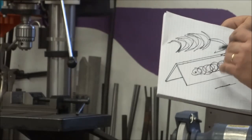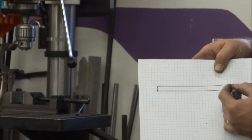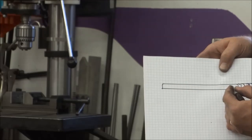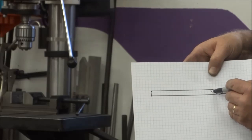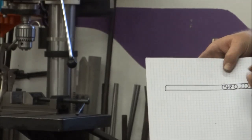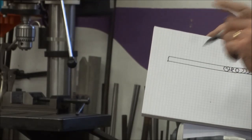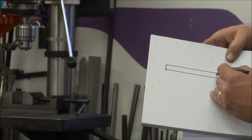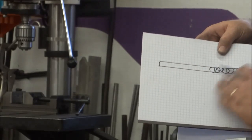Like I said, again, you want to stay on the leading edge of that puddle. So here's another illustration. This is kind of, you'd be looking straight down on it. You're basically going to be moving ahead, pushing it forward, and then you just loop back, and you're pushing that leading edge forward, looping back, pushing that leading edge forward, and you're just kissing the two sides. So you want to make the width of that weld bead consistent. That's why you're going in motion. You want to push it to one edge, push it to the other, push it to one edge, but you always want to stay on the leading edge of that puddle. You're just coming back enough. Basically, you're not coming back to come back onto it. You're coming back to push that puddle out to the other side, so you're working on your whip, your consistency.